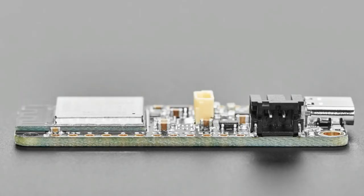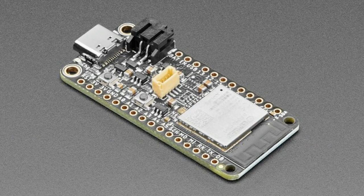If you do, make sure you're running the very latest CircuitPython release code, and check the Arduino code, because we changed the polarity of the power pin from low on to high on. But we have a little snippet of code that, no matter whether you have the B version or the C version, it'll work. So if your I2C isn't working, just go check out the code snippet I've got, put that in there, and it'll activate the I2C port, whether you have this version or the previous one.